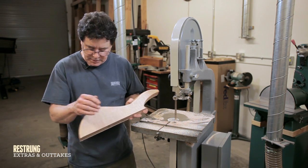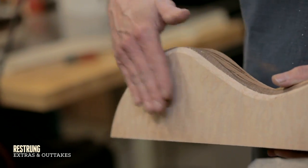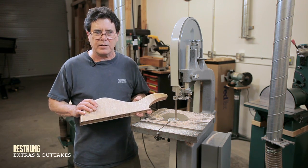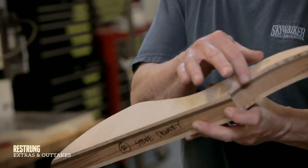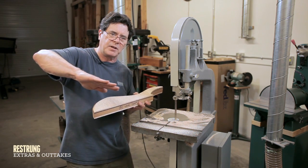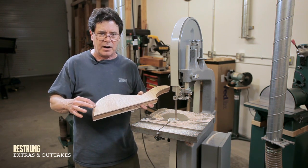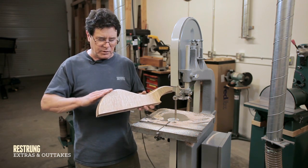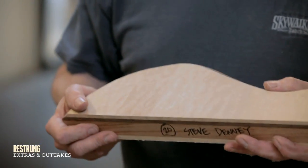This is the area where your arm goes over to play the strings, so I'm going to take more material — I want a long wedge area. I view the way I do these angles: I don't use a fixed shape. Some people use a shaper or a router to route a fixed radius. That almost feels like — I love driving on a road where you go around a sharp bank and all of a sudden you realize it's banked at a particular angle and your car just hugs the road. To me, the grace of the lines of a guitar — you don't want the same radius the whole distance. It says mechanical, it says a machine did that. I want the contours to gradually change everywhere to figure out the grace of the lines of the guitar. That's why I do it all by hand.